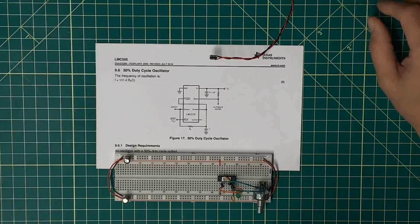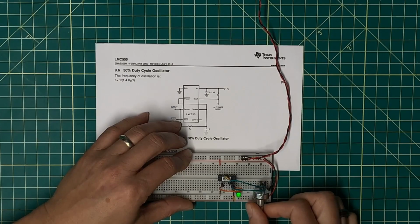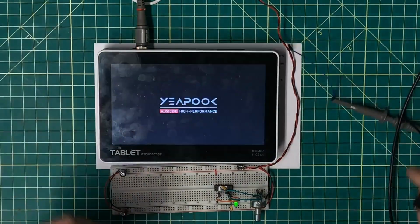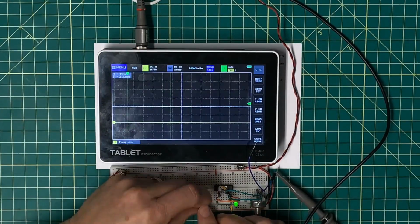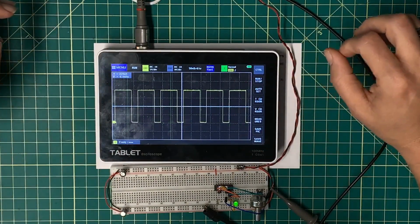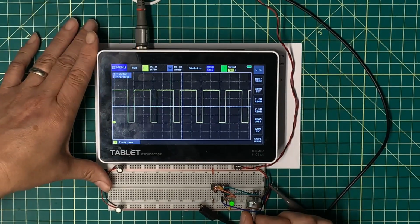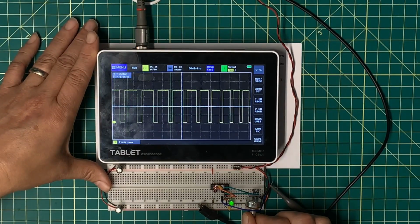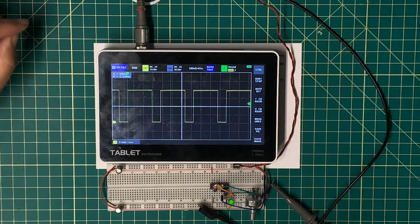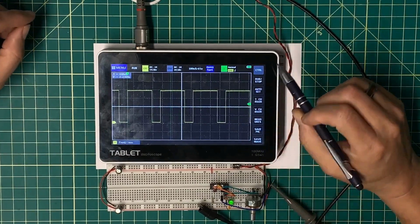Okay, I'm back in chronological sequence again. So once again, this will flash and it oscillates properly. I want to take a look at the shape of the square wave here. This is my ground connection, my output. Shape of this square wave isn't fantastic. It's got the same problem, it looks like, as the other one did. But if I speed this up, there we go. That still at least has the same shape. In other words, the high side of the cycle is longer than the low side of the cycle.